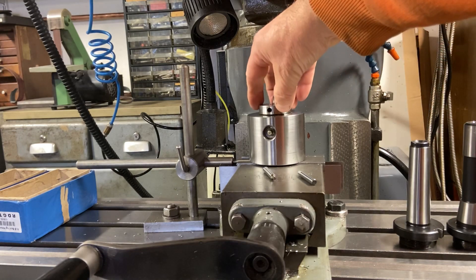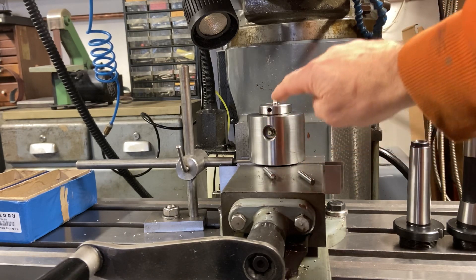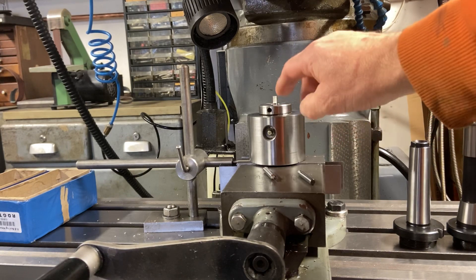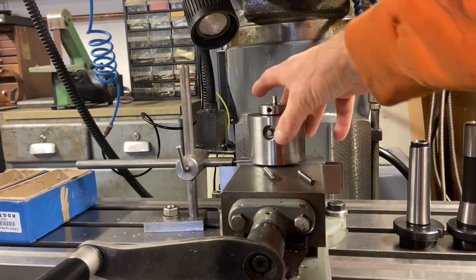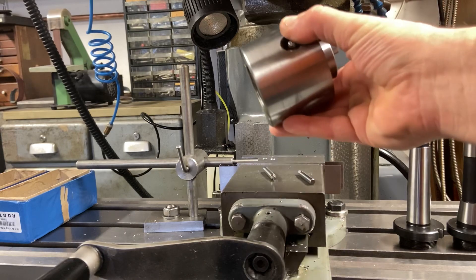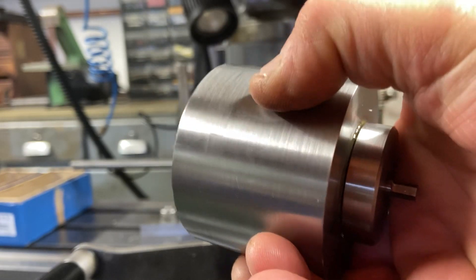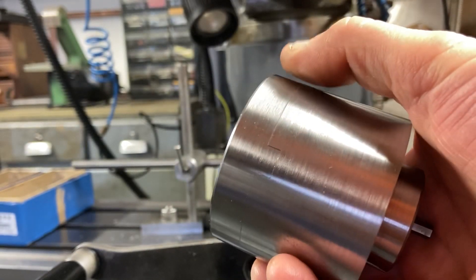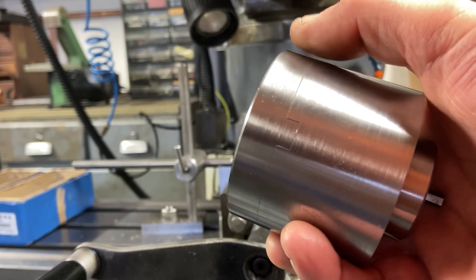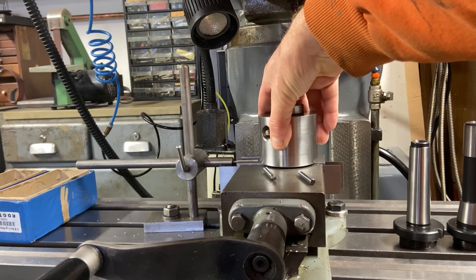This center part is machined at one degree inside the main body. I put it in the machine and turned over the top to get it all concentric, because it's made in two pieces. This top piece has the one-degree angle on it, machined parallel for the bearings, then it was bolted to the lower piece which had the one-degree angle on it, and then turned all true to give the one-degree that you need.